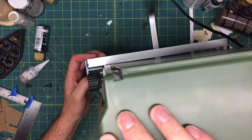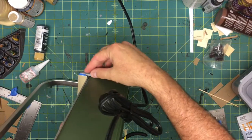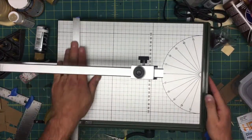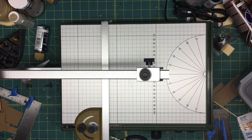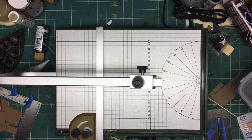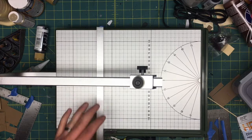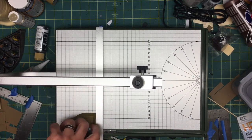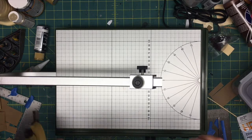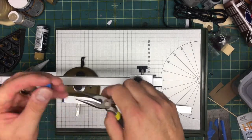What I'm going to do is move these arms down one eighth of an inch — that'll be perfect. The back one is flush. The reason for that is I needed to be able to lock it in this direction but have it be able to move this way. A very simple solution, easy to make. If you've got access to a 3D printer, print these with as high a quality as you can. If you don't, I'll put some links below to services that will 3D print them for you. These are printed in PLA and took about 56 minutes total. Now my fence is locked in. If you're wondering how hard it is to pull them out, just take a pair of pliers, grab them, and tug — it will come out. But when it comes out, the tape will have to be replaced.